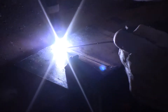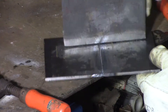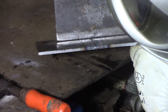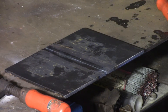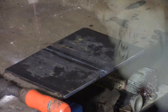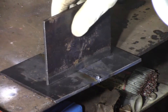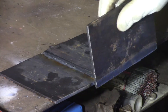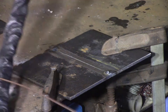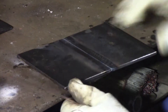A lot of you fellas out there that have been taught how to weld properly might have a better way of doing this. Through experimentation, I found that the best way to weld these without getting much warpage is to put a tack on each end with a small root gap, and then weld between the tacks. That seemed to give me a pretty good result. I had a small V on the reverse side of the plates, and I ran a very small V down that as well. In hindsight, I think I could have achieved the same result, and possibly looked a bit neater, by having a larger root gap and just filling it from one side.